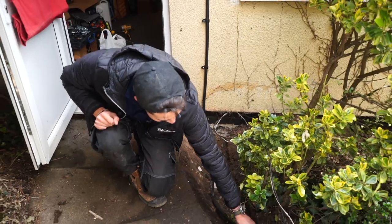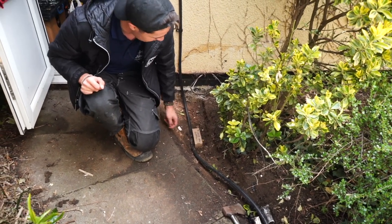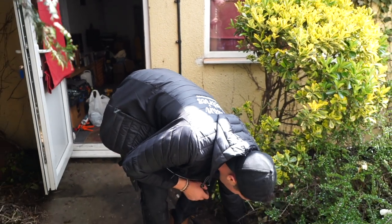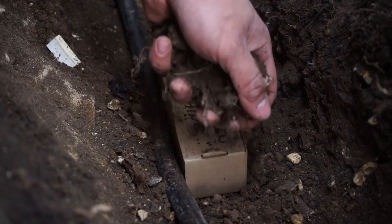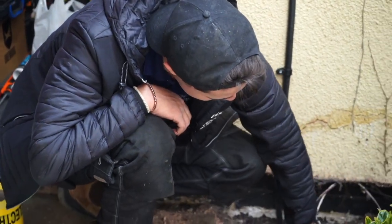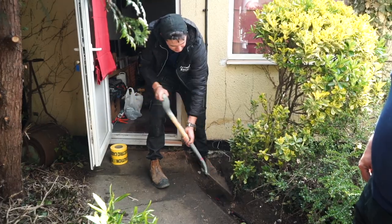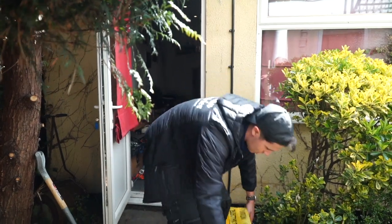600mm under - we tried to go deeper here but we couldn't. So what we're going to do is alert the customer. We've left a bit of slack so we can either dig it down deeper through this concrete, or put something hard over it - maybe a bit of tile tape. We'll just put a bit of backfill. Ashes to ashes, rust to rust - that's a thumbnail right there. I was actually a grave digger once. Gold digger - big difference. So we'll backfill it a bit. We'll get a bit of tape on it and lay the tape on the very top as well until he gets it sorted. I'm not happy leaving it like that really.